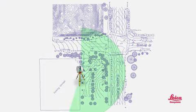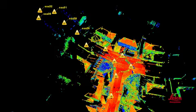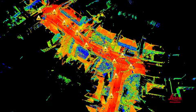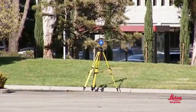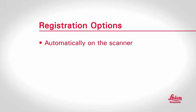Now, what if you need to capture an entire scene where some views may be obstructed, or if a site is so big that the scanner can't reach all of it with one scan? In those cases, which are very typical, the scanner is moved to different vantage points for more scans. The best vantage points will be based on site logistics and scanner capabilities. Multiple scans can be automatically aligned with each other. If the scanner is properly equipped, this registration step can be done right on board the scanner; otherwise, you can do this later by post-processing. Some methods use handy scan targets or markers placed around the site; other methods don't need any targets. It's important that it be done accurately, and Leica scanners and software have all the right features to let you do it with confidence.